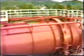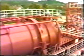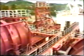The ship is a 29,999 tons of deadweight chemical oil product tanker, fitted with 39 FRAMO stainless steel hydraulic-driven submerged cargo pumps, type SD-150, two submerged pumps, type SD-100 for deck tanks, one FRAMO portable cargo pump, two FRAMO ballast pumps, as well as bilge pumps and fuel oil transfer pumps, all driven from a centralized FRAMO designed hydraulic system.